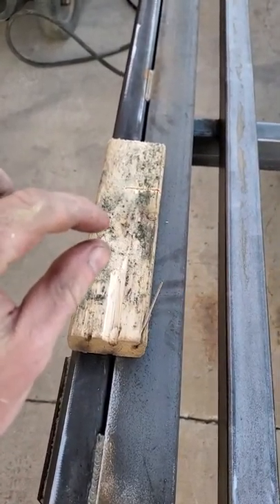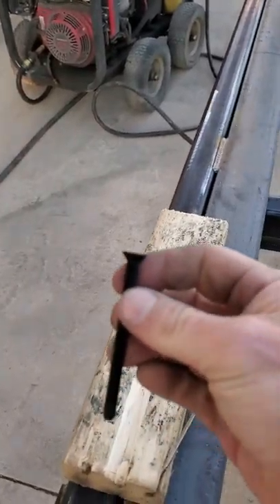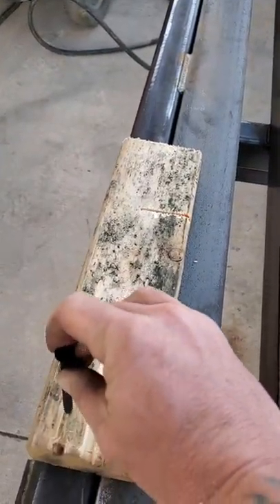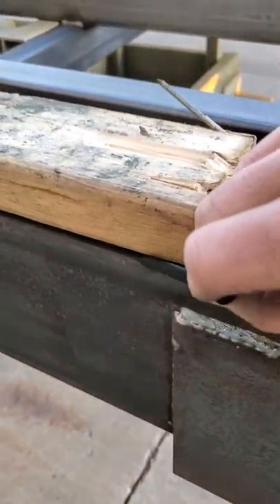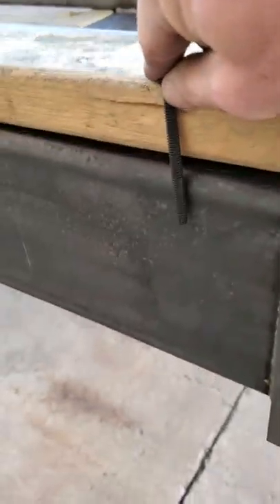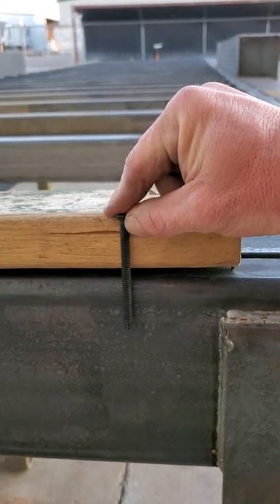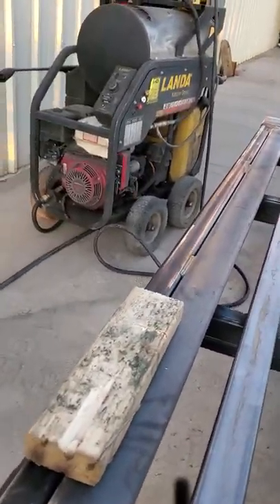Screw and drill. You can use a quarter inch by one inch — it's got a quarter inch hole in the middle and a one inch hole. A little flat washer. Here's a two and a half inch deck screw — put the fender washer up here and sink it all down in there nice and tight. Drill all the way through your subfloor; it should be sitting in between the steel and the bottom plate. This will give you more than enough bite.